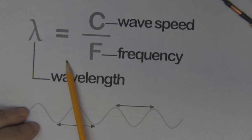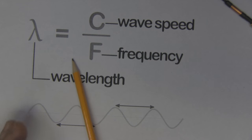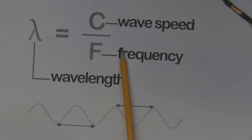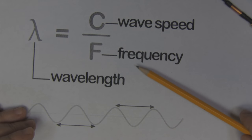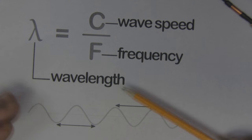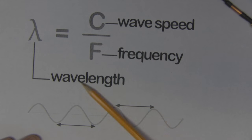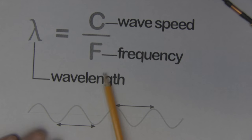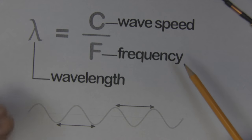When you Google the wavelength at 2.4 GHz, remember that equation works in free space — propagating in ideal conditions you'd never get in the real world, sometimes calculated in a vacuum with ideal materials and next to no loss. You have to factor in the materials you use, the dielectrics, the conditions it'll be used under, and what you're going to use it for. There's a lot that goes into designing an antenna — it's not just a paint-by-numbers equation where you cut your copper wire and you've got an antenna.